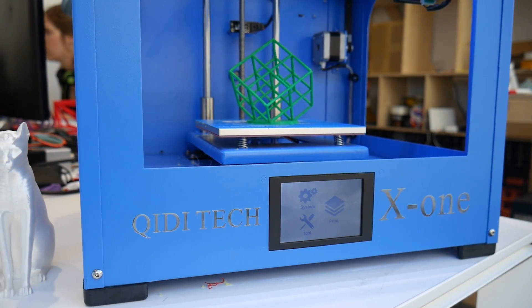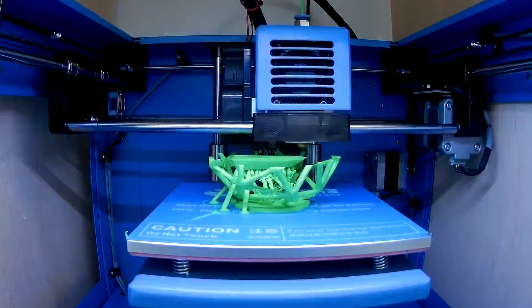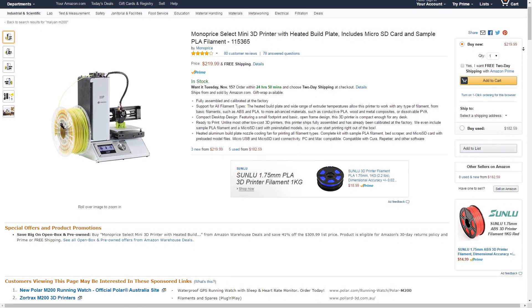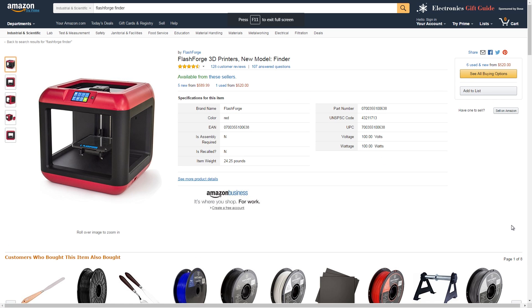Final thoughts on the GD Tech X1: I was damn surprised with the prints off this thing. Once you get it going, it's just so easy to throw files at it, and with a print bed that doesn't move you can do delicate, detailed objects with no fear of them failing. Certainly the stock software sucks, it's very noisy, and the Z-axis seems to have full steps with a lot of resonance in the sheet metal enclosure. But for the price point it occupies, it's a pretty good little robust machine. At $438 US on Amazon, it's not crazy cheap like the Malyan M200, but it's a more rigid fully-supported sheet steel design rather than a cantilever. The Flashforge Finder is the closest comparable machine and that's $100 more, though you do gain auto bed levelling while losing the heated bed.